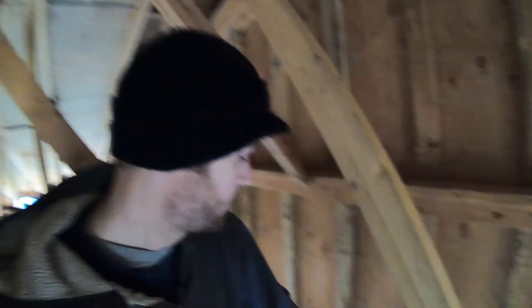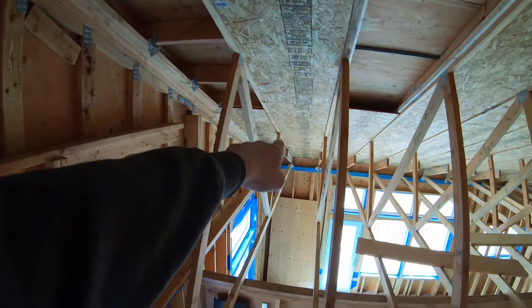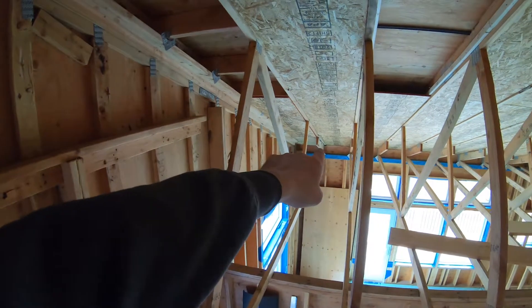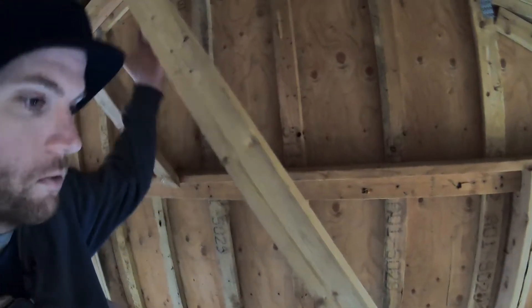So again, it's just toenails. In a big uplift, not only could the roof peel up, but this whole gable could just come up. You're relying on the ends here — some hurricane clips. And the way they did it, there's no hurricane clip in the corner because of the backing for the sheetrock, so the first hurricane clip is actually back two feet on each side. I've seen videos on YouTube and wind tunnel tests where this connection is the point that fails and the whole roof just comes off.